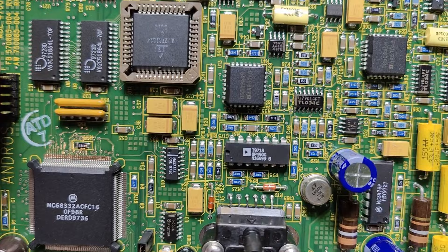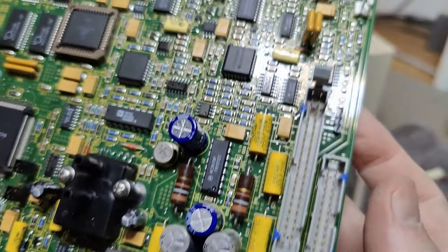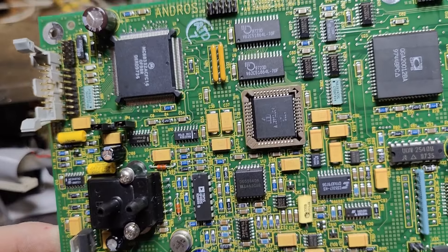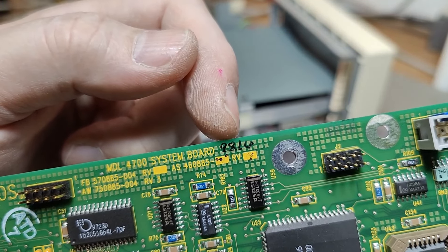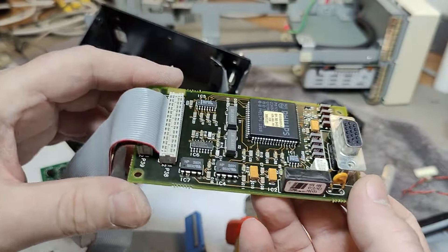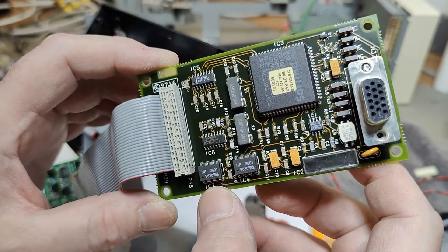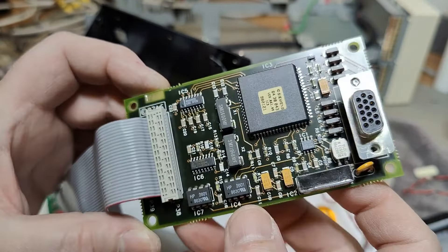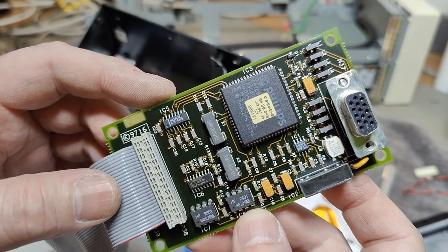A little bit of Analog Devices — it's full of analog circuits obviously. I haven't found the layer indicator so I don't know how many layers we've got. It's also handwritten up here, 98. This is the external interface from the back side. We've got some optical optocouplers and a little DC-DC converter for isolation, and the rest is connected to the external world. This is quite typical for medical for good isolation to patients.